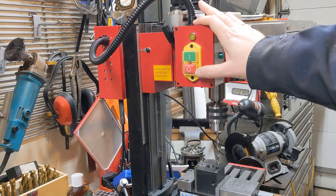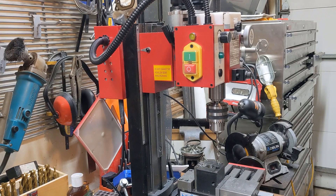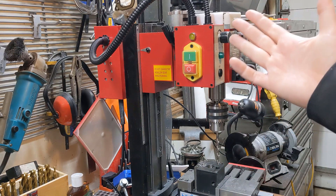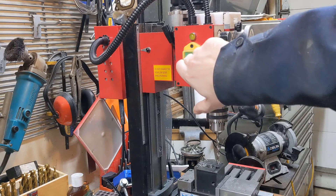One of the things that I've had trouble with is drilling. When I first got it, I tried to drill out a broken-off stud in the head, and I had to go extremely slow because it kept overloading. Yesterday, I tried to drill into some plate steel - it kept overloading. Tried to drill on this, kept overloading. Even a center drill, just a simple center drill, would get this thing so that it would overload and stop. This light turns on yellow when it's been overloaded, so I did a test here. Take a look at this.